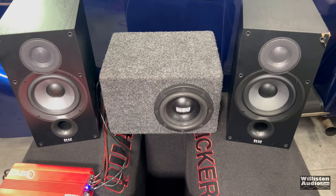We have the amp bridged — we'll try 2 ohms dynamic bridge; that's one ohm per channel. It's not rated for this but we'll just try the dynamic run and see what it does. It came out of protect, so it doesn't like that load.